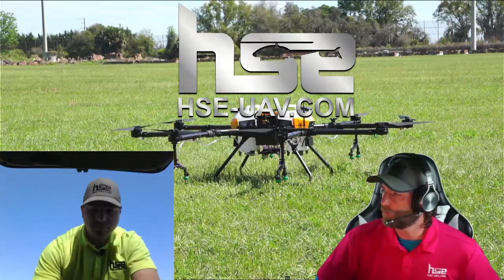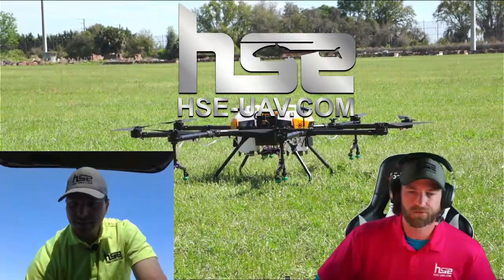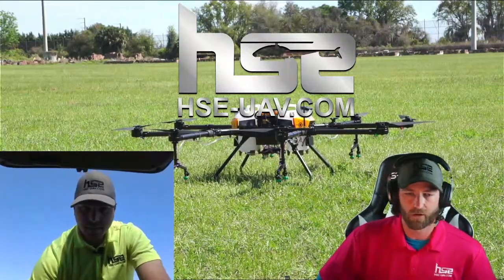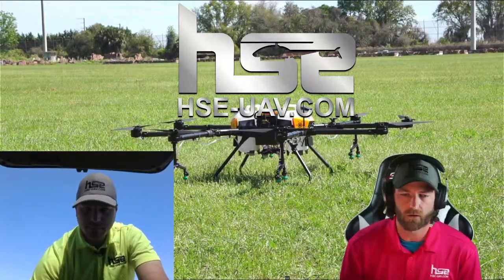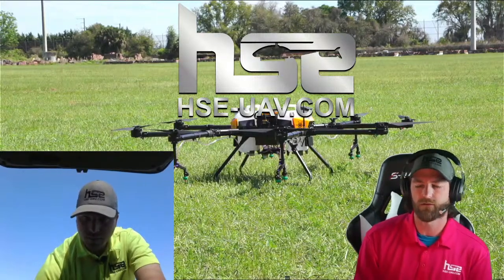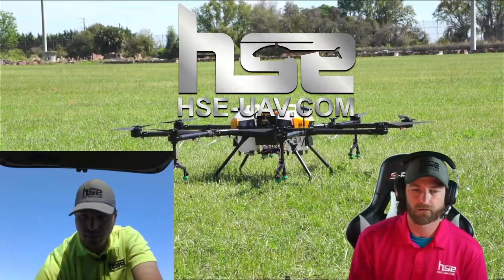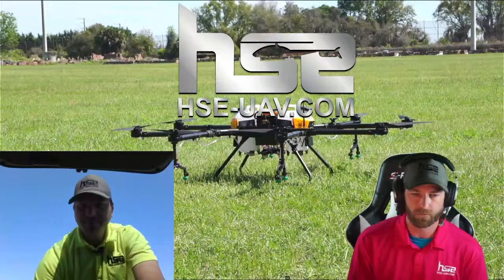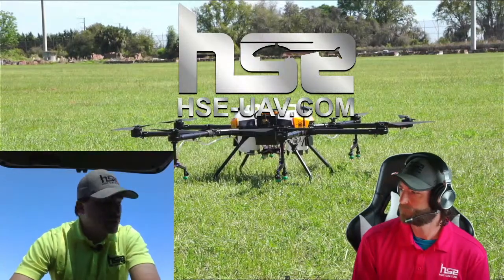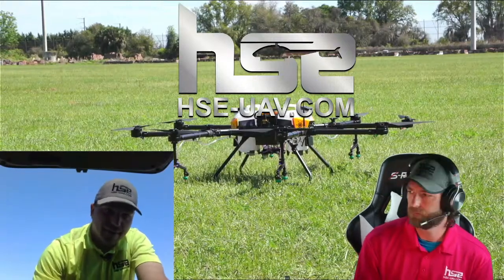The other question that came in is about flow rates of the nozzles. Richard, the nozzles that we have standard on this machine and all the machines are the TJet 110-01 nozzles. Each one allows for 0.1 gallons a minute, and there are 8 nozzles on that machine. So even though it can pump 1.1 gallons a minute, with this setup you're limited to 0.8 gallons a minute. But we find that is more than enough to achieve some pretty big numbers with 30-foot swaths. I'm going to send it back up and try one more time, but John, I'm going to keep you on to answer questions while I test this, and I'll switch the camera over when I'm ready.